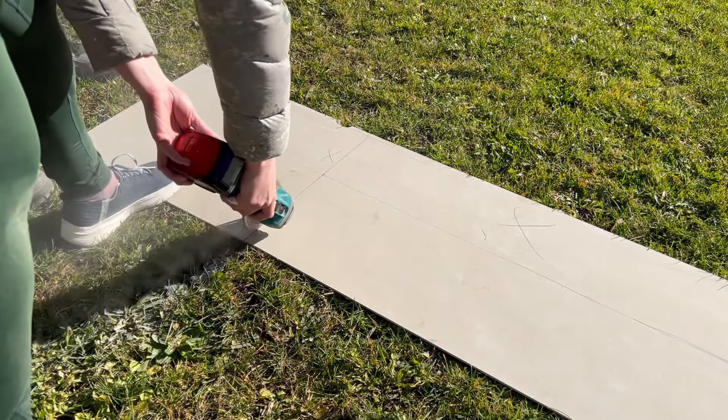I got to work installing the tiles at the bottom of the shower side. These tiles needed a little bit cut off because a full tile wasn't going to fit up against the shower base, so I cut them down to size and made sure to get them nice and level. It was then time to finish off the tiling around the bath hob — I installed the metal strip that was the edge between where the two tiles met, then put the glue on. These tiles were all cut down to size and because they were cut, I needed to get my stone and run it along the edge of the porcelain tiles so they wouldn't be sharp to the touch.